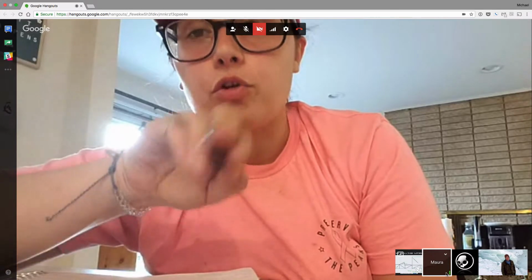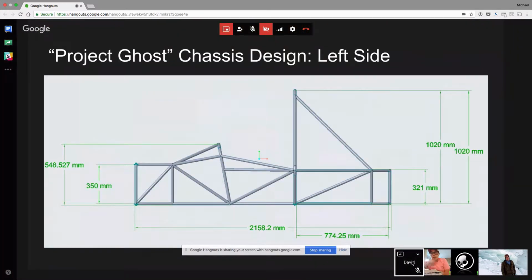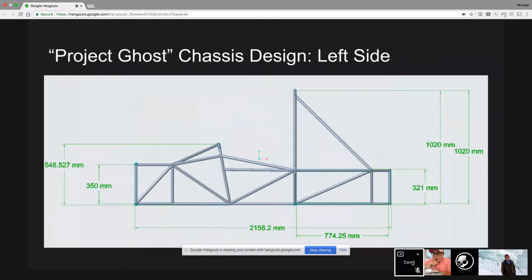It's actually from the ground up, so it's from the bottom to the ground. Okay, yep. Just want to make sure you're considering ride height. Yeah, it's at 332 right now, and the rule's really weird how it says between 300 and 350. So I think that's why we tried to put it as close to 350 as possible, because we're not sure what the ride height's going to be yet. Okay, yeah. I think they give you that leeway because that would be your 2 inches of ride height travel in jounce and rebound.